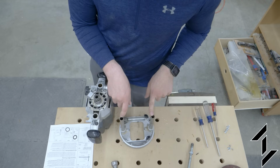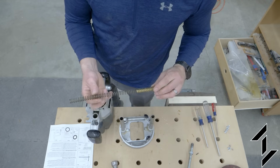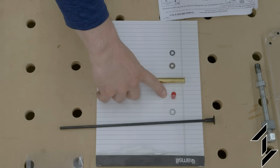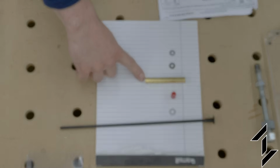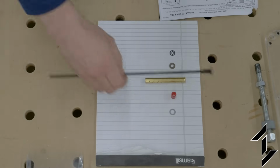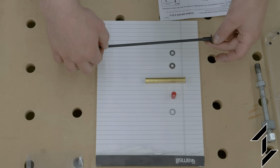Now the springs and brass spring guides have already been removed. They look like this. Okay, next step is to grab the number 1 main shaft, number 7 washer, number 9 nylon red bushing, number 13 hollow spring guide, number 14 steel 3/16 washer, and 1 of the number 15 retainers. Next up is to cut this number 1 main shaft down to 8.5 overall inches.